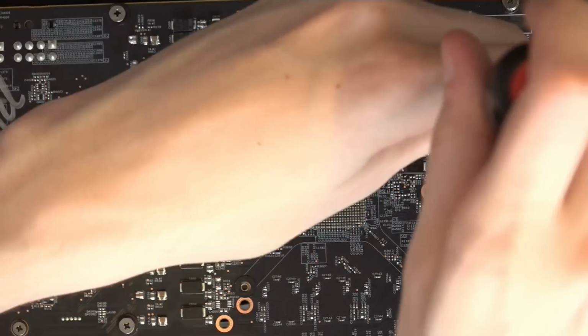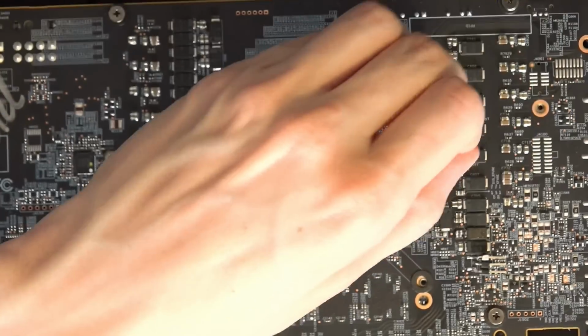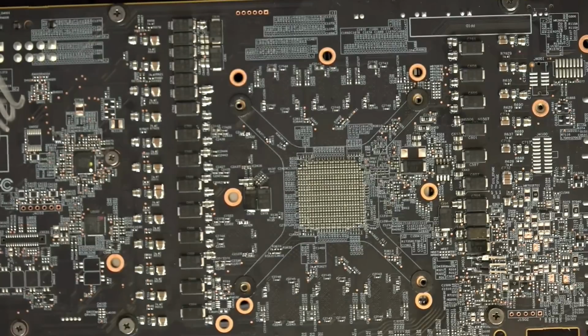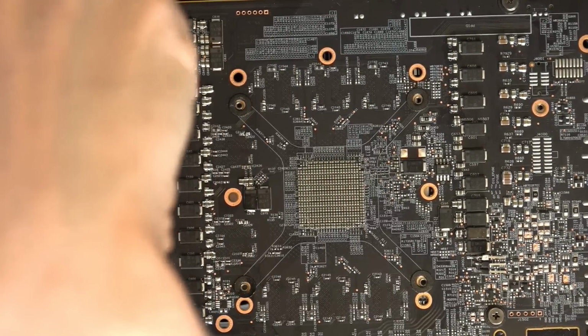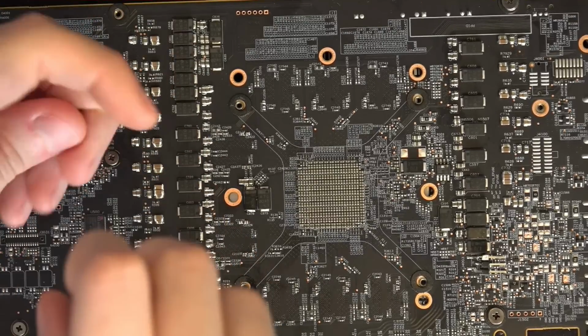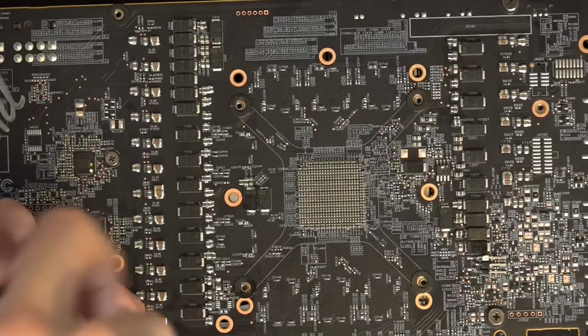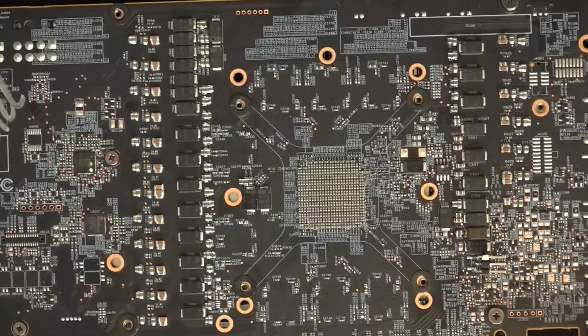It's very different from what I'm used to, where it's like, okay, now it's artifacting, but the performance keeps going up. Now it's artifacting more, but the performance keeps going up, and now it doesn't run anymore. That's the usual expectation for most GPUs for me, and this doesn't do that at all. This will quite happily look perfectly stable and then just drop. Sometimes it'll reset the whole system, and sometimes it won't, which is kind of interesting.